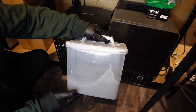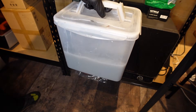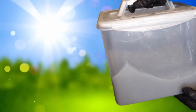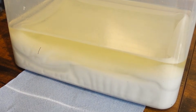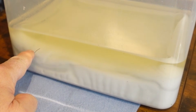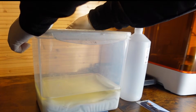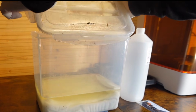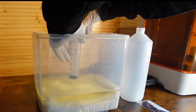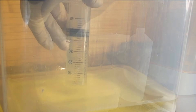I'm going to put a lid on this little Tupperware box — you can see all that horrible nasty stuff in there. Then I'm going to do nothing more than put this in the garden in an area where it's going to attract sunlight. Even in the UK in winter, UV rays are shining. A couple of days later — about three days later — the resin has started to cure, fallen to the bottom, and has left cleaner IPA at the top. It looks a little off-coloured, but it's cleaner than before and we've got something we can use.